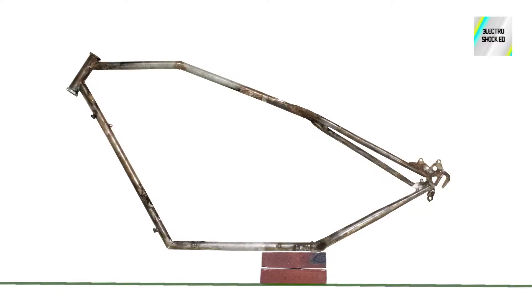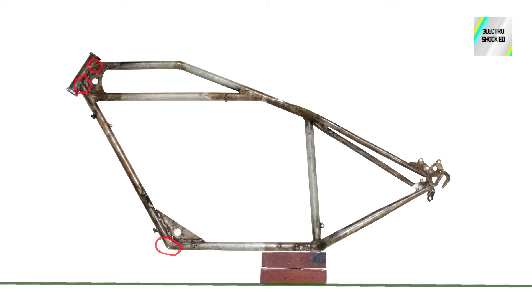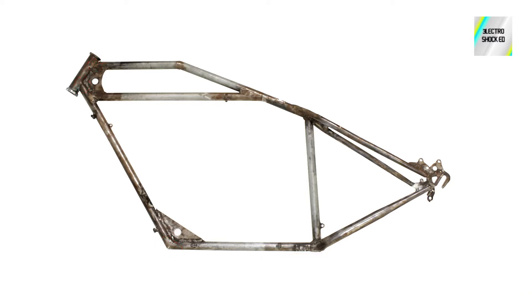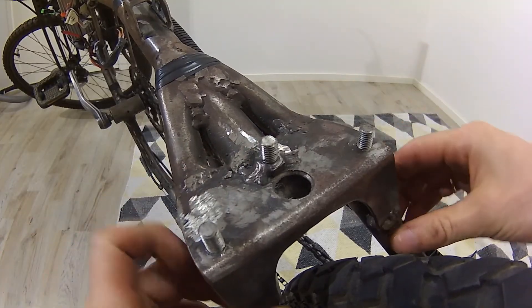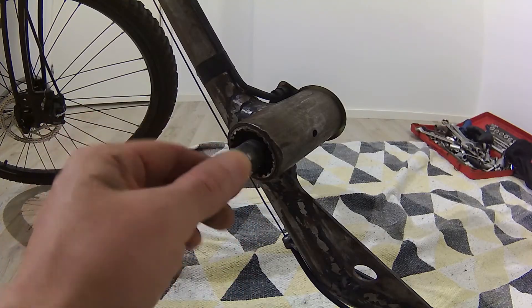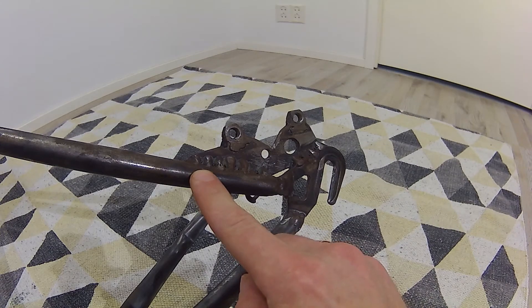I took the tires off those rims and adjusted the tack welds all around the frame until the whole bike was straight enough to stand on the ground by itself. It was a hassle but it worked great. Next it was time to make this structure strong and solid. To reinforce the rear end I welded a seat tube to create a triangle structure. I also added a tube that helps support the front part of the frame. After that I tack welded some pieces of sheet metal to make these fragile connections stronger. Now the base structure was ready for the final welding — time to connect the seat bracket, the bottom bracket, and other small things like mounting points for a brake caliper.